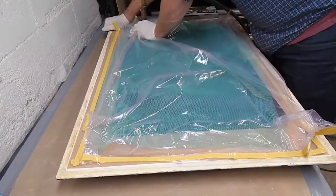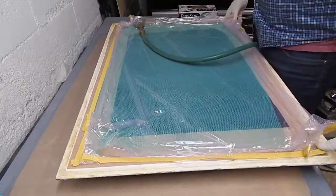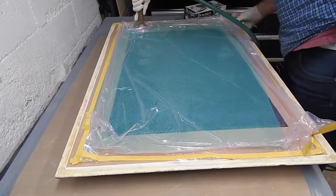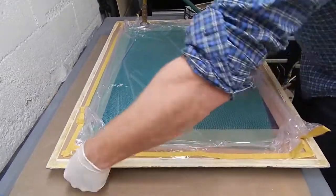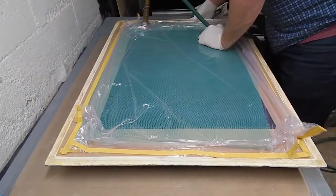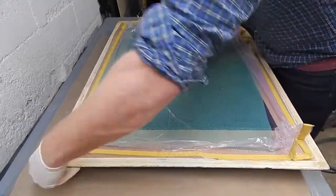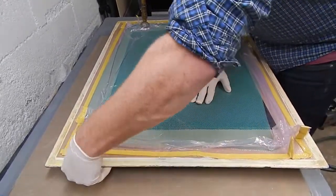I'm going to squish this down and try to make sure I'm not baking in any wrinkles in the laminate, and just give it a minute to come back and make sure that first ply is stuck down well — that only ply on the first skin. In most cases you would apply a film adhesive or glue film.